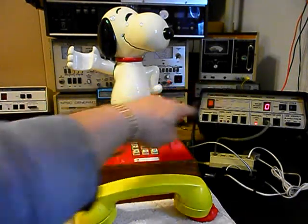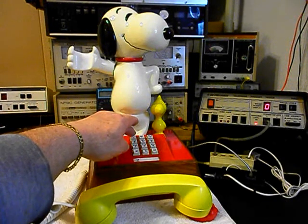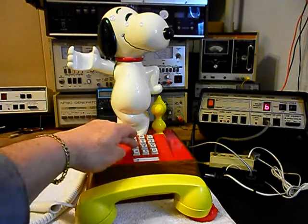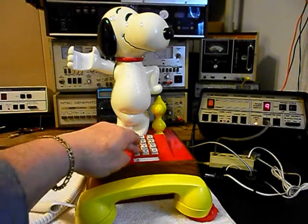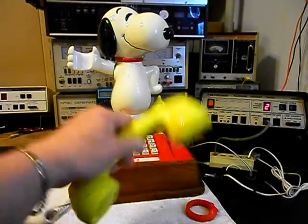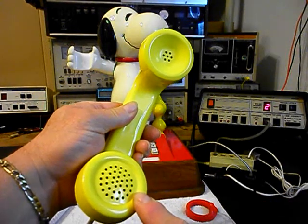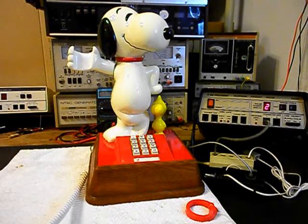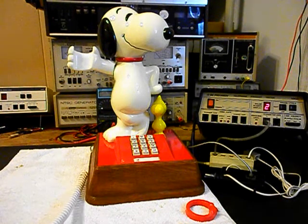We want to walk through our numbers — if you watch the analyzer, you'll watch the numbers roll by. I'm going to end in a 2. Now I want to transmit into the handset. If you watch that red light on the analyzer, every time you see that red light light up, that's an indication of 100% modulation on transmit. One, two, three, four, five, six.